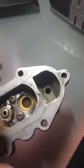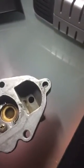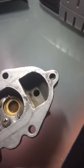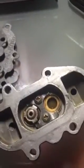They all have this shape — just make sure that they all meet the shape. Inside you have the intake valves; I've already replaced mine so I don't want to remove them again. You're going to remove the screws, remove the intake valves, and there are two gaskets — remove the old gaskets and replace them with the new ones.